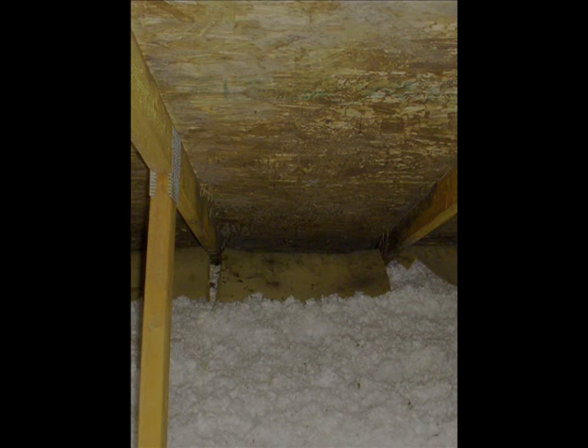You can see right down in that corner where it's dark that there's been a lot of mold in this particular attic. Here's another problem we see all the time: even in the best attics, the insulation is often being messed up by people walking through it to get to things. A catwalk needs to be built to stop this from happening.